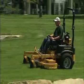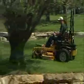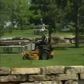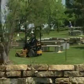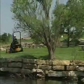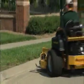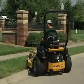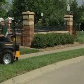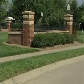Under no circumstances should you approach sharp depressions or raised obstacles at a high speed. Hustler tractors aren't designed to jump over gutters or curbs, for example. Attempting to do so could cause the operator to be thrown from the equipment. Instead, you should approach obstacles at a slow speed and angle one drive wheel at the obstruction until it clears, and then pivot the opposite wheel around.